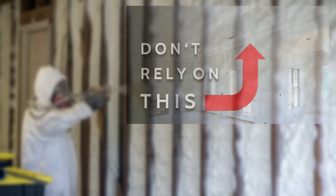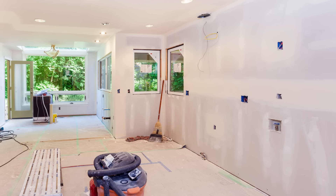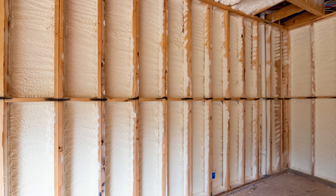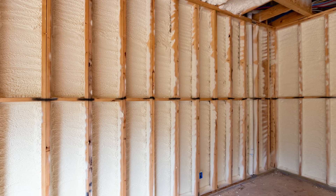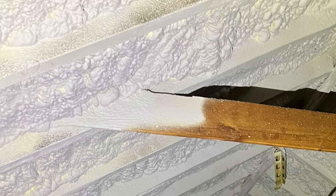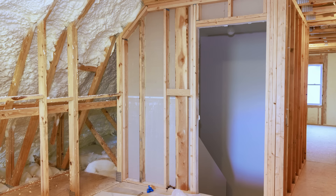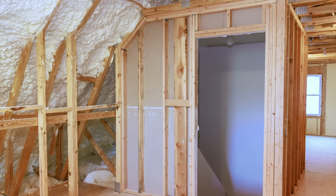The next comment is about spray foam: 'Just use spray foam — costs more but way better. Airtight drywall sounds ridiculous and way too much work and expense — no thanks.' I generally agree about the airtight drywall approach, and we want to avoid it wherever possible because people like to poke holes in it and it's not very reliable. With regard to spray foam, we've had a lot of problems with both closed cell and open cell — it off-gasses a lot, and it does not always bond to the substrate even if it looks like it does. We've taken apart a couple of spray foam assemblies for both walls and attics.